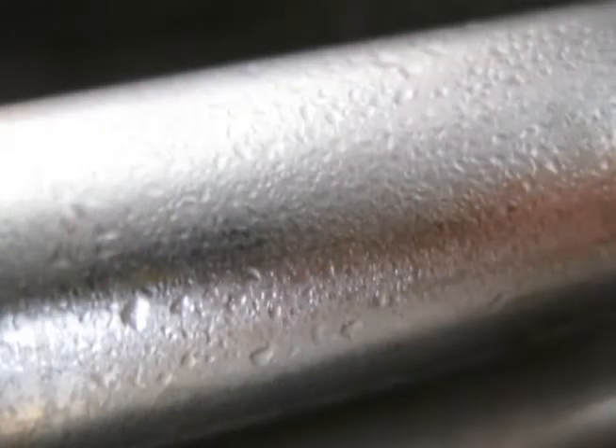This is just that steam hitting that cold bellows and condensing, and that's exactly what happens in your flue gas lines. It's going to be acids that condense on the inside of that. You don't want that.